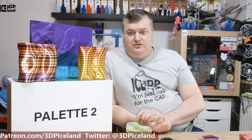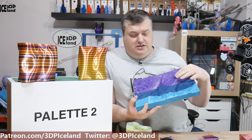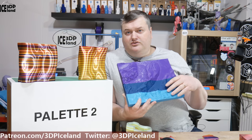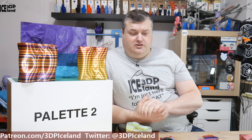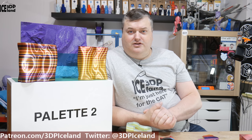In my experience this has been a great success. I've had a really good time trying out different modes and seeing what works and doesn't work. I was trying to splice different types of materials together like nylon to PLA, and that was not very good because PLA doesn't stick to nylon. But you can have a look at their website — they have a good list of materials and settings on what splices together and with what settings, and you can adjust the pressure and temperatures between splices. My final thought is maybe you should have a look at this device. It's been great fun, and if you have a use case for multi-material prints, it's a great device. It's not cheap, but it's well worth it — a well thought out device and the engineering on the physical device is excellent.